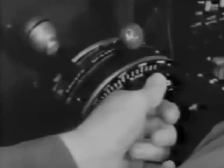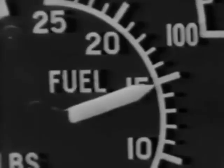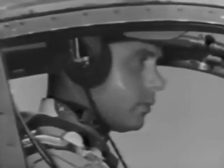Finally, to be sure that everything is in good order, there's a checklist provided on the instrument panel. Refer to it and go over everything once more. Are your fuel tanks full? Is the selector valve on reserve? Prop governor pulled forward, automatic rich on mixture. Fuel pressure up to 14 to 15 and a half pounds. Oil pressure up. Oil temperature okay. Coolant temperature okay. Suction up. And is your gearbox oil pressure okay? Now you're all set.